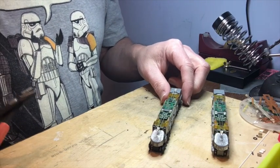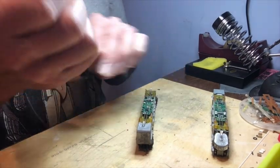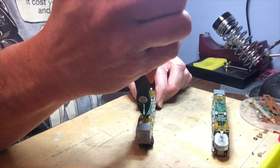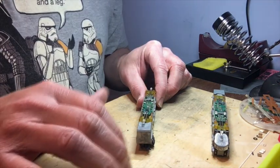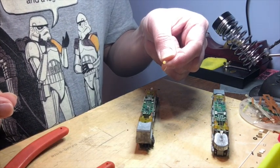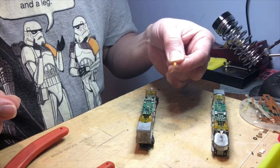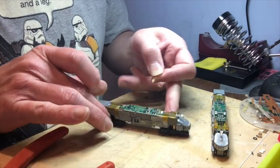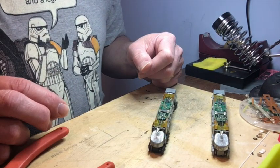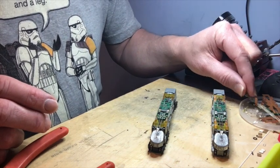All right, seeing that the locomotive ran very well without the cutting out, I'm going to cut off the rear headlight that I will not need. It's always a good idea, at least for myself, to save these because the headlight is still great. Nothing wrong with it, it just isn't needed for this model, and is a great spare for when I have another locomotive, or if sometime down the road the LED headlight no longer works on this one, I can easily use the same leads, solder on, and I've got myself a headlight. So hang on to those things if you think about it.